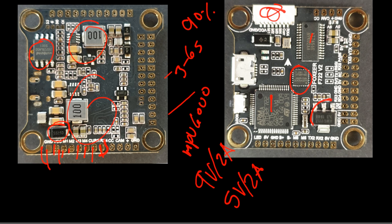They're using a pretty big 3.3-volt LDO regulator, which is pretty insane. LDOs are usually much cleaner than switching regulators in terms of noise. One of the most important things in a quadcopter is to have clean 3.3 volts because that's where the microcontroller, the gyro, and the OSD all run. If the 3.3 volts is noisy, you'll see OSD flickering, weird twitches — the voltage noise can bleed into gyro data and make it think the quad rolled when it didn't, causing completely untunable behavior. It's really nice that they have all this filtration on board.